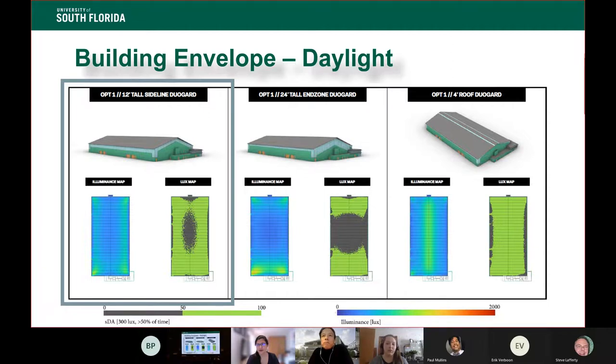The central option that we ran was just on the ends. This was a cost option. This was the, what happens if we just do it on the ends? Can we get enough? We knew that was unlikely to work. That was the least effective of the three options. Our goal was that nice, even, diffuse area. And this got us 30-foot candles, which is enough to practice without any additional lighting. The only time they have to turn on extra light is if they're doing any broadcasting or film. And those are pretty infrequent. So we were really happy with the way this settled out.